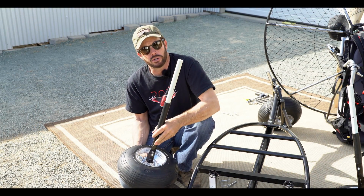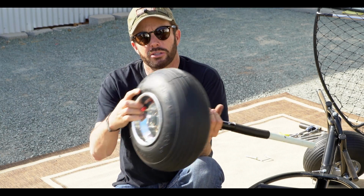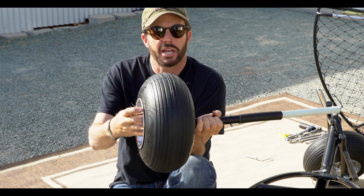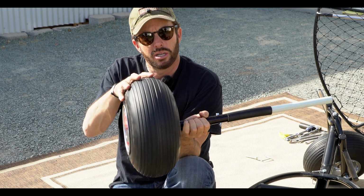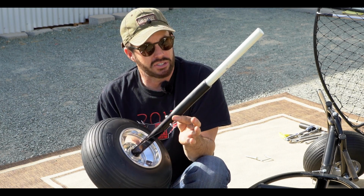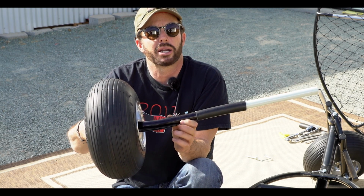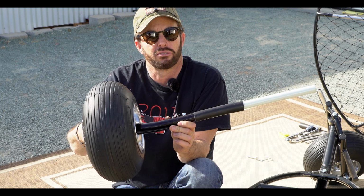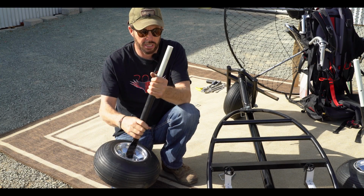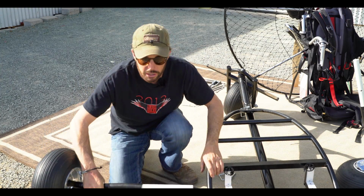The next thing we're going to do is install the left rear axle. I've already put the wheel on. Notice the nut. When you put the wheel on, tighten the nut so that the wheel spins, but it's not loose. To determine if it's the left side or the right side, look at the little flapper here. It's welded to the bottom of the axle spindle itself. So this tells me this is the left side. If you need any help installing any of these, you can always use a little bit of WD-40 on it as well.